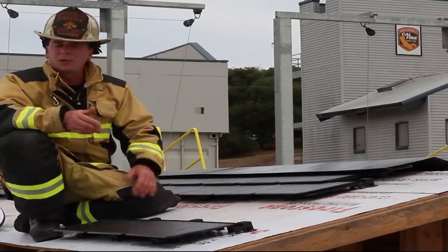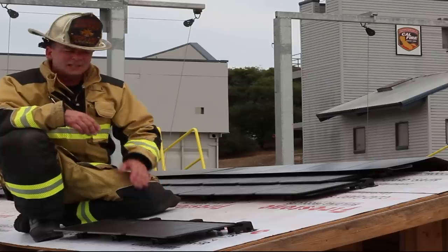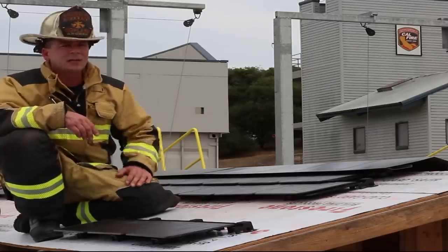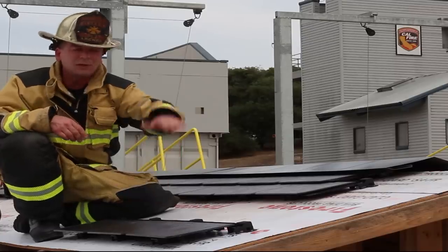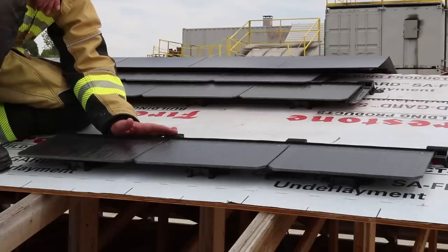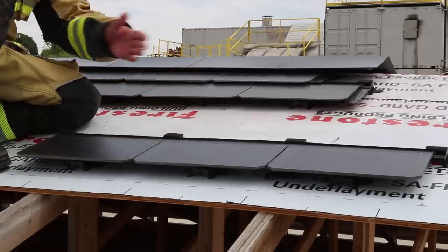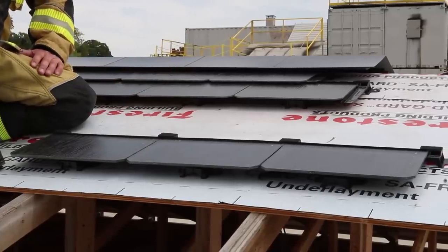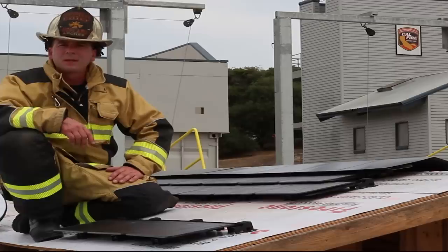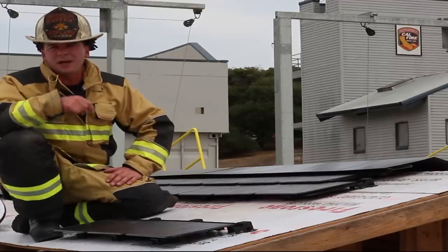The other reason that we may want to pull the shingles out of the way is if we're moving horizontally on the roof. If you're moving horizontally on a Tesla roof, you can actually remove a line or two lines of shingles, and the top of the shingle below where you've ripped off can provide a good footing. That's another reason why we may want to move the solar shingles off the roof. Papa will show you how that's done.